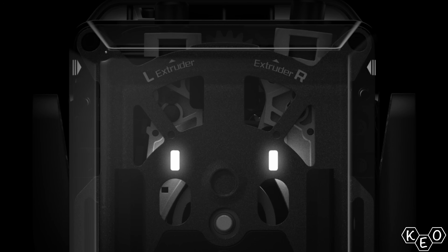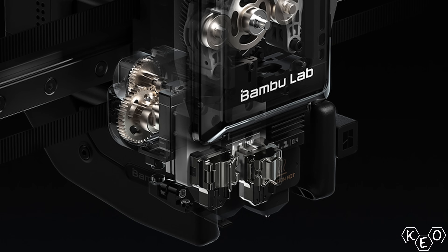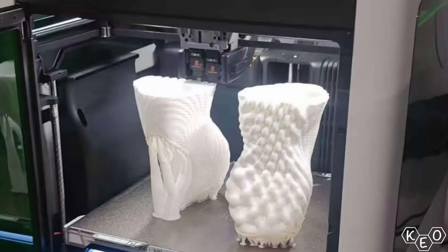This could unlock some convenient possibilities. For example, you could have a 0.4 nozzle on one side, swap to a 0.8 on the other side, and use the really chunky nozzle to do infill while you use the finer one to take care of the outer perimeters of your piece. So you get faster model printing time and nice crispy outside edges. It's super exciting to think about because you don't even have to commit one way or the other — you can just swap nozzles as you need. And this machine is going to be expensive.